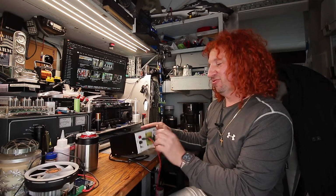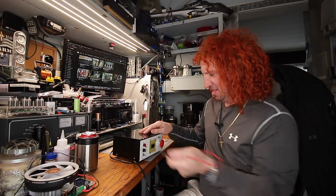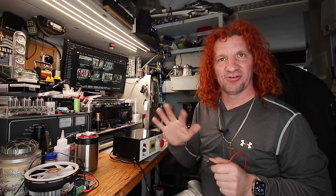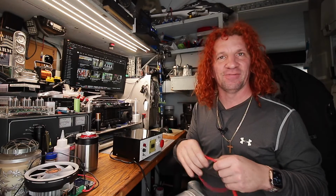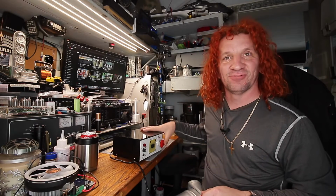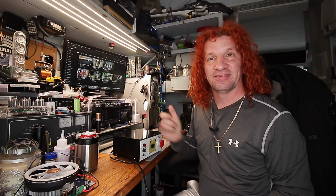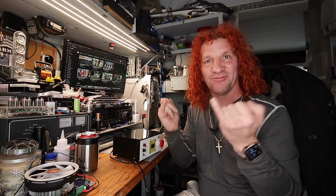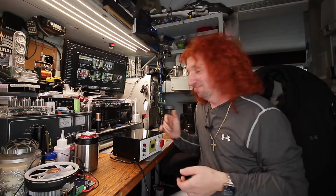So this is that commercial incandescent light fixer that you plug your light set in, and you make sure that the whole set is out, even the working part. So if you've got a working part, you pull out the first bulb, so you get 100% non-working. So all the energy when you smash this button goes to the section that is not on, and you zap it. So either you're going to get zapping or arcing of the sockets, you'll get zapping of the wires if they're broken, or it fixes the shunts and then the light set comes back on. So that's how this thing works.